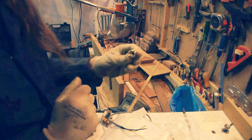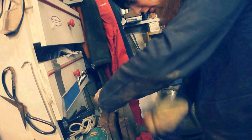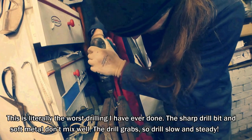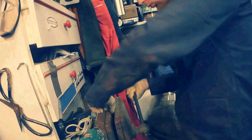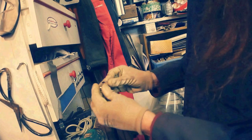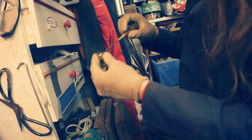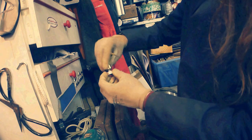If you get ones that have a solid centre, so the whole thing is just made out of whatever metal it is, and crucially, a grub screw to attach it on, what you can do with it is this. Insert knob in vise. That one, not the other one. And then we drill. And then, it's like a dream. Take a screwdriver, wherever I put it, screw the screw, and there we have a knob that fits, is centered, is straight, and turns nice and easily. So they're ready to fit.